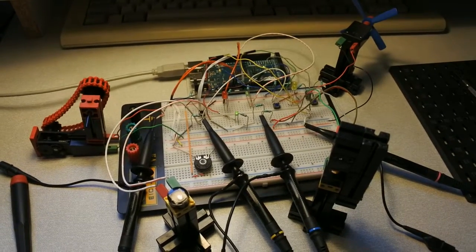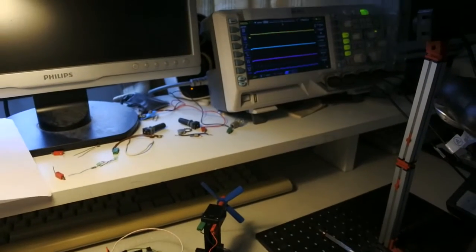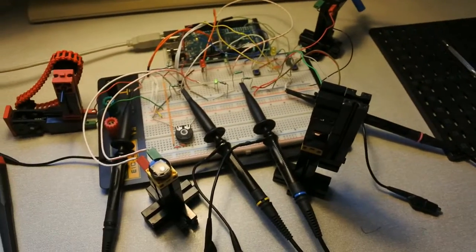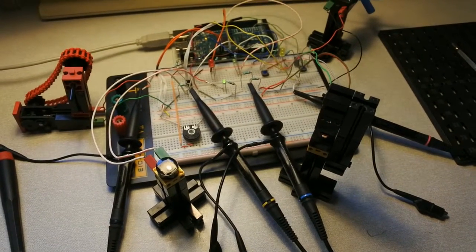And with the several probes you can also see on the oscilloscope, well, at the bottom is the signal that is actually the control to the motor. I can change the time base a bit. But this is the way it is set now, by way of the potmeter, by the way. So which is which? Then line above the pulse modulation is the signal to the lamp, and that is this lamp, and that will be the focus, or part of the focus for now,